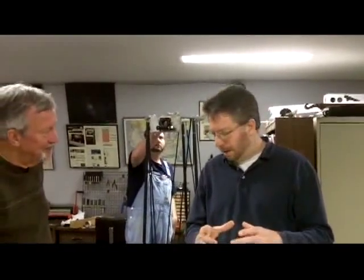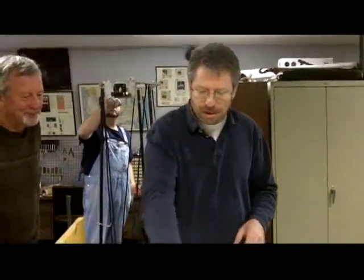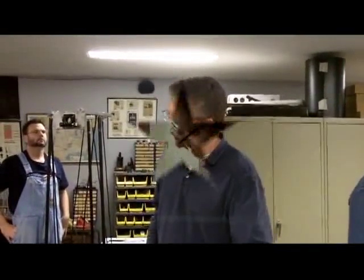Did a lot of the grinding using a ring tool. Once I cut these tiles down halfway and wasn't even close to where I needed to be, I went and built myself a ring tool. It was a four-inch flange, one of the 6-inch flanges, and I screwed a nipple into it and put a cap on top of that, so I made it work. It definitely took it down twice as fast and saved my tool. Then I was able to switch back and do this.